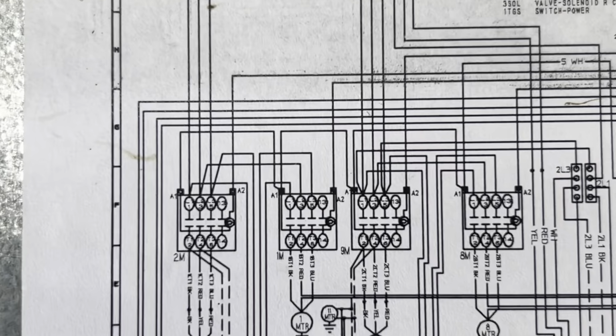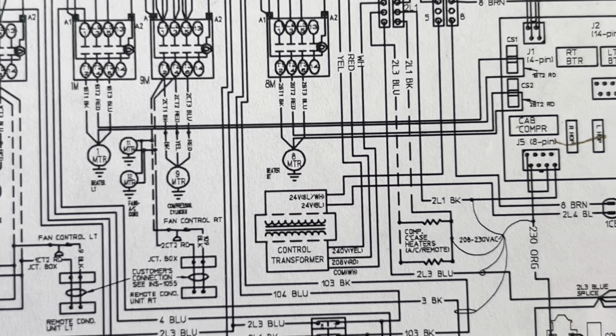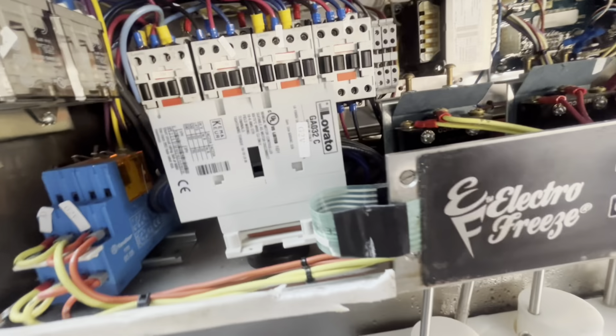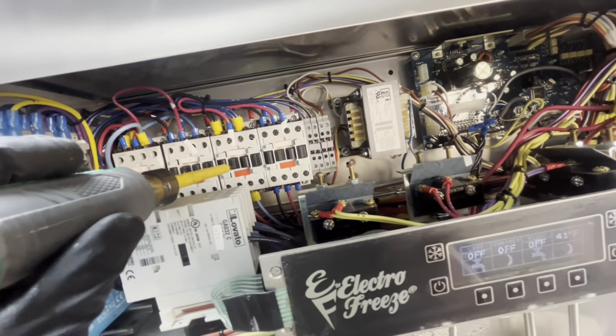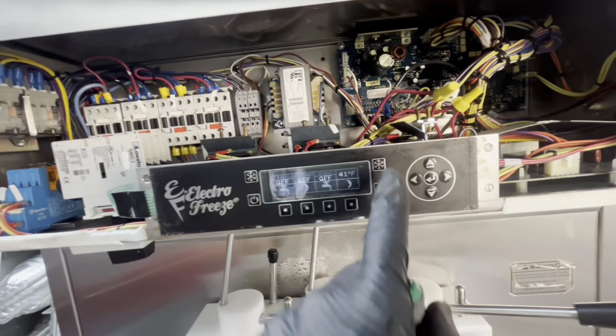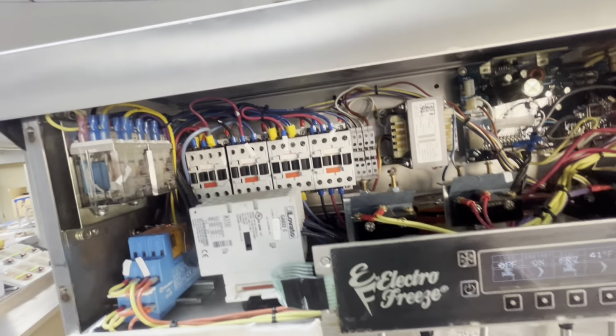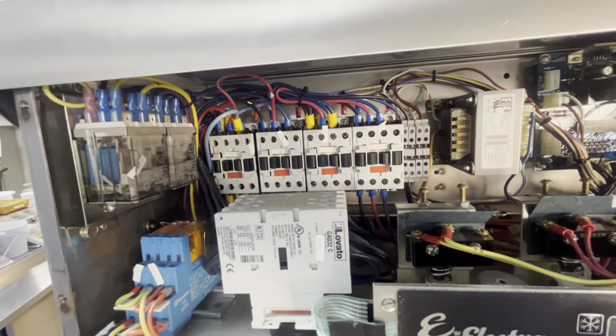Motor. Okay. So, compressor. Check the coil wires, seem tight. So the compressor, when I ask it to run, runs. When I ask it to run here, ooh, she ran that time. So I need to check coil voltage. I need to check, because I didn't hear that contactor pulling in. Let's run it a couple times. Oh, yeah.